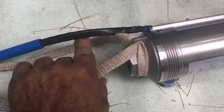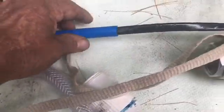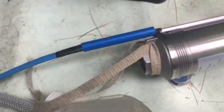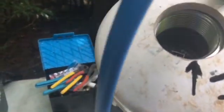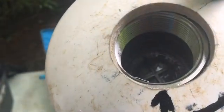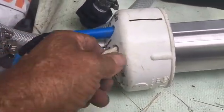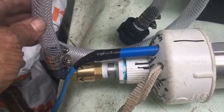To secure the pump end, I put this nylon tape on it. I've wrapped some black electrical tape over top of the well wire. I'm going to put this piece of PEX tube over it, then slide the cap up on it. There's the power line coming out of that hole, the pull tape coming out of that one, and there's the hole we're going to thread the fitting into with the check valve. This is the pull cord anchored to the pump, the fitting screwed in tight, and everything turned so the outflow is coming straight up.